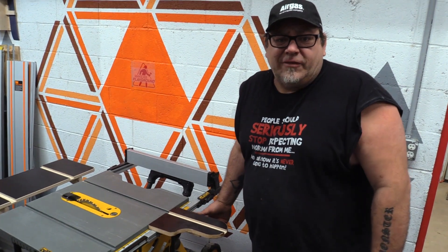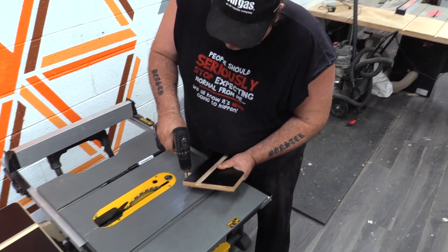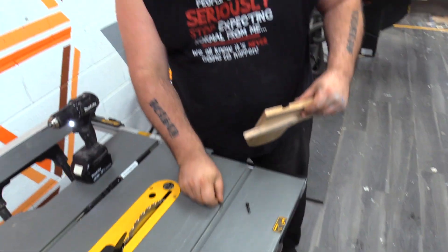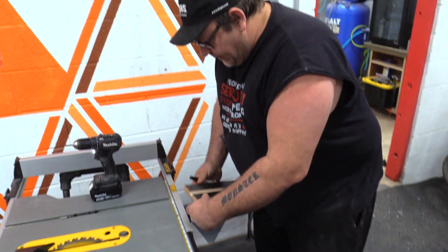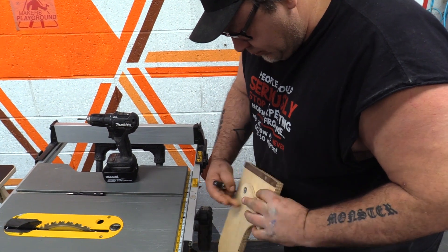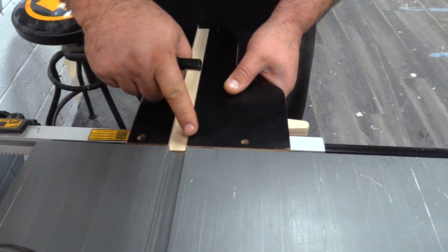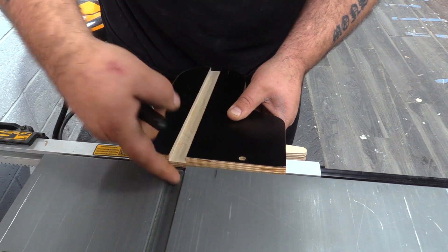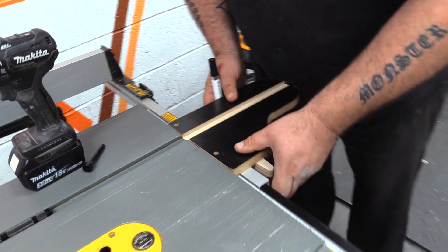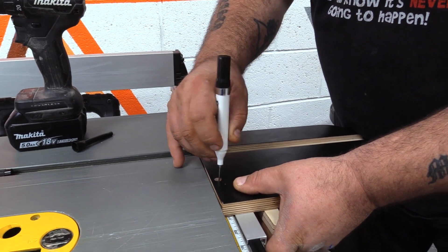Let me show you how easy it is to lay these out. You want to start by removing the two hex head bolts that are in here, and then just line up — make sure that the clamp is in this position here — and then you want to line up the miter slot with this miter slot. You'll notice this miter slot is a little bit bigger. So for those of you with miter gauges that tuck under each side, there is room for that to slide in here. You'll just want to mark both positions. Make sure it's nice and tight up against the saw, take a long-nose marker, and mark those positions — both here and here.